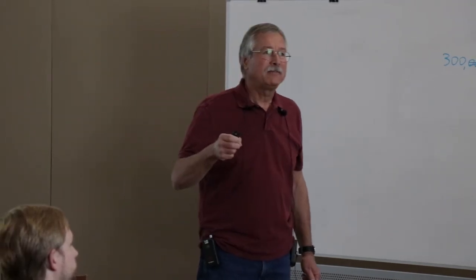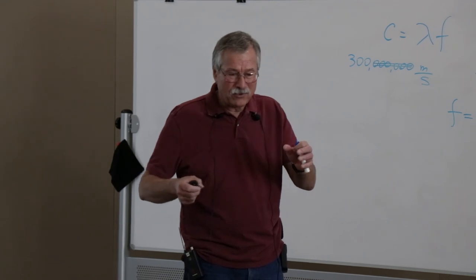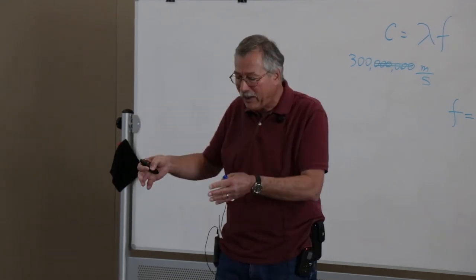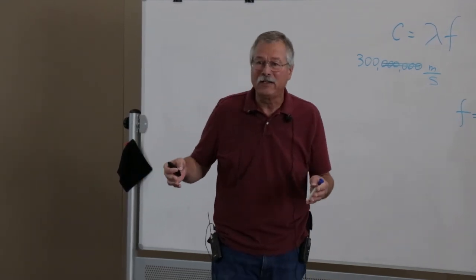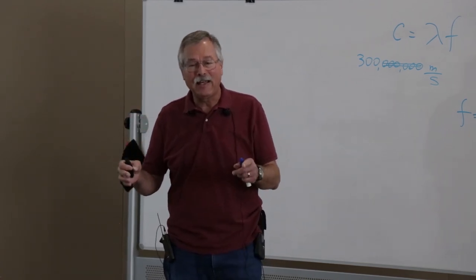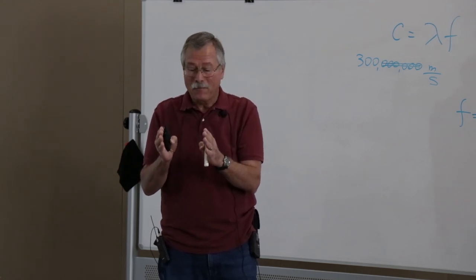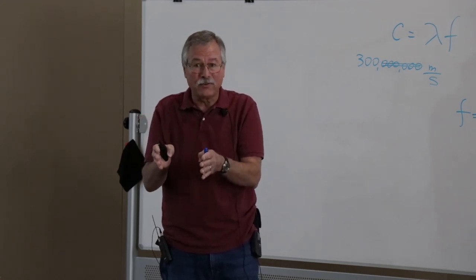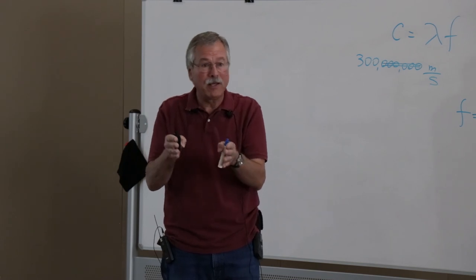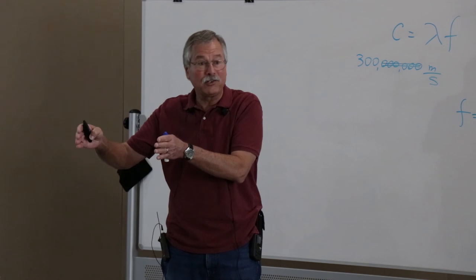Now, people say AM is not as good as FM because on my AM radio, the stations aren't high fidelity, but on my FM radio, the signals are high fidelity. It's not because of the type of modulation we're using. It's because on the AM dial, we're only allowed 10 kilohertz of bandwidth, and we're using 6 kilohertz of that to send upper sideband and lower sideband. And then we have a little guard band, and then we have another radio station.